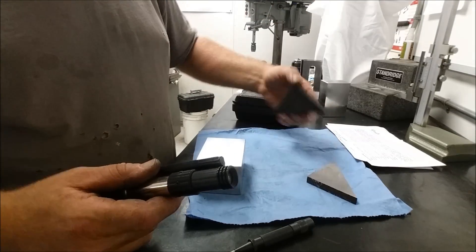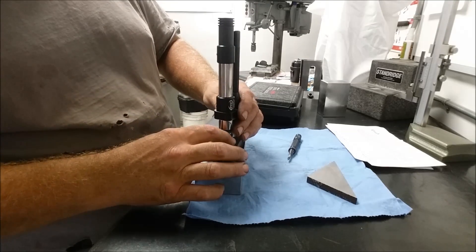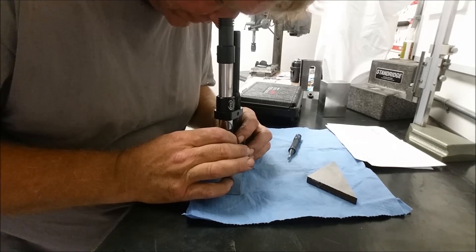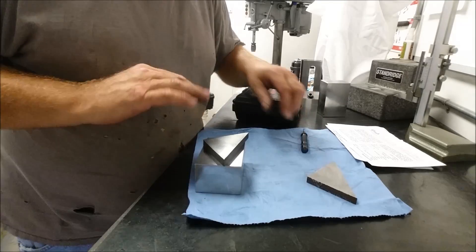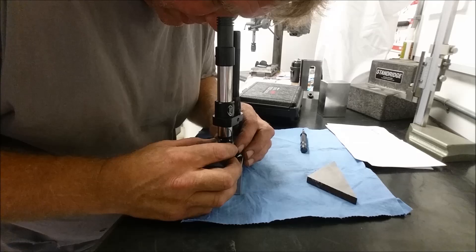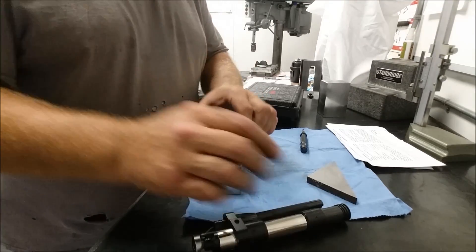So she got pretty hard — not as hard as O1 tool steel, which gets up in the 60s, but close. I'm going to give it another snap and get another reading. My last was 60 right on the dot, and now I'm getting about 61 to 62 — pretty consistent. I'll do another one: the reason I surface ground it is you have to have a specific finish to get this reader to work. You can't do it on a belt sand, bandsaw cut, disc grind, or anything like that — it's got to be a pretty nice finish. 60 again. So we're getting good repeatability: 60, 61, and another 60. Three readings. Yes, Adam — it gets hard.